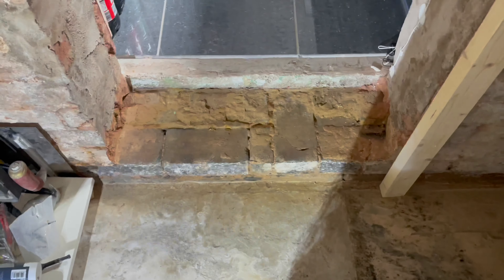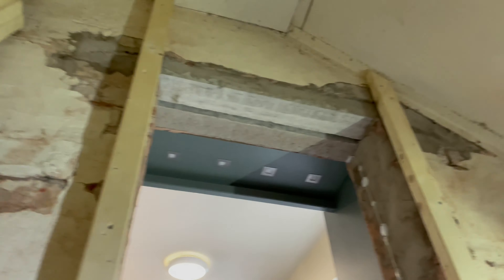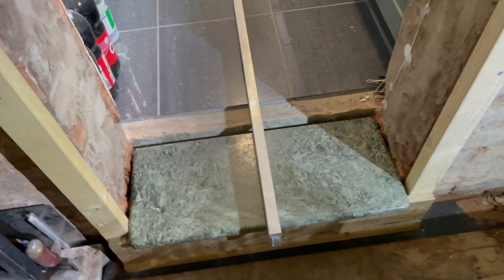Let's get these timbers up here because I can't sort of step out until I do it. That's where we've got to so far. I've got a bit of DPC — damp proof course — to go there underneath this tin former that I put down to try and square it off. I'll put that board in there because that's the height I want the cement to go to. I'll just show you that in a minute — that's what it's basically going to look like.